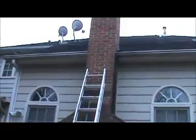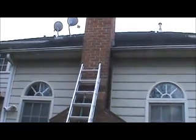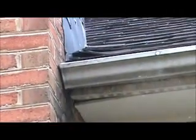Also, got a little bit of breakage right here on your shingle and some exposed nail heads there that will need to be caulked also when we do the core vent. All right, everything else looks pretty good. Back of the house, we've got some leaks going on around the chimneys. Right here at the flashing, which is causing our soffit and fascia boards to buckle on us a little bit. We'll get up there and have a closer look at that.